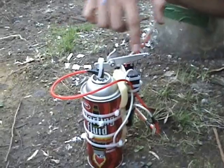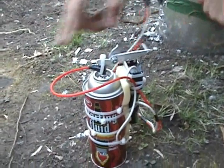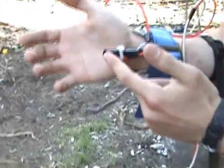The second mechanism is a four-bar with a lever arm here that uses this servo to press down the nozzle on the can of fuel, sending it through the line up to next to the burner.